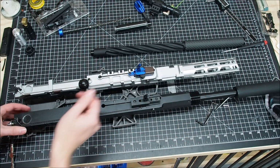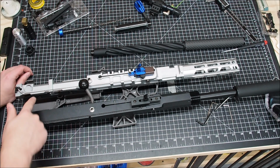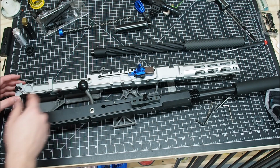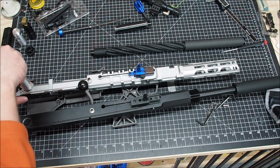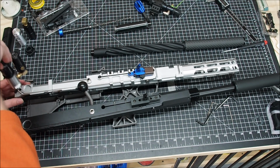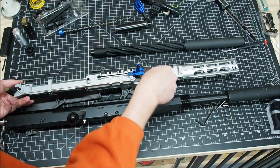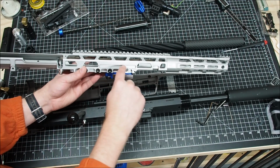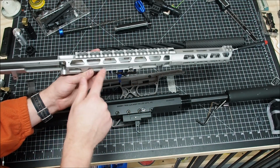If you compare it, they're literally only keeping the parts here and here that allow the barrel to be clamped, and back here is where the bolt goes through, and just the bits to hold your trigger bar lever here, and just enough around the monopod slot. And just for a little proof of concept, it's still the same thread. So they've done so much excellent work, and all the slots here, the machining is beveled, and they carefully went around and sunk in here, but kept it so that all the trademarks are still visible, keeping it in the design in an aesthetically pleasing pattern.